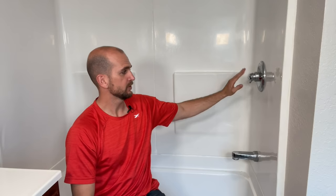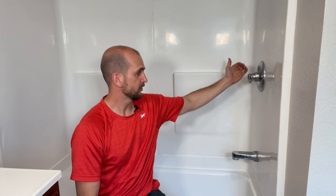Good news is there is an easy fix for this and often it just takes a couple minutes and really no tools, depending on what kind of tub spout you have. Usually this issue comes from the diverter on your tub spout. All the diverter does — when you turn the water on from your mixing valve, the water flows through the path of least resistance, going down the pipe and through your tub spout. Then when you pull up on that diverter rod, that blocks the path of the water.